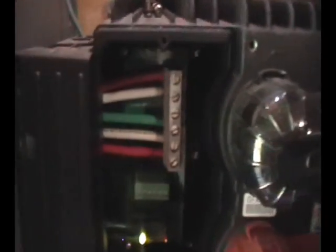If I pull the cover off here and look inside, you can see there are two red wires and two white wires. One set of red and white wires is the grid circuit and the other set is the backup circuit. So you have one in and one out on this inverter, and the same thing on the other — the other in and the other out. The circuits terminate on a double-pole 60-amp breaker in the grid tie panel and a double-pole 60-amp breaker on the backup panel.